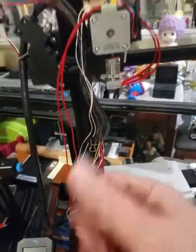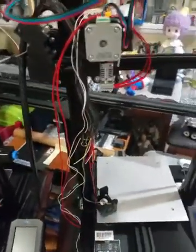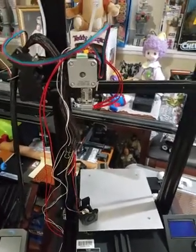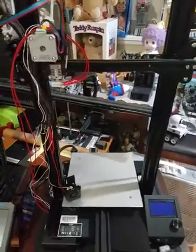Result? All good. No more error. It goes up to temperature. What I was seeing was, as I dialed in a temperature of 180, everything went fine. I did a PID calibration at 185 — that went perfect.